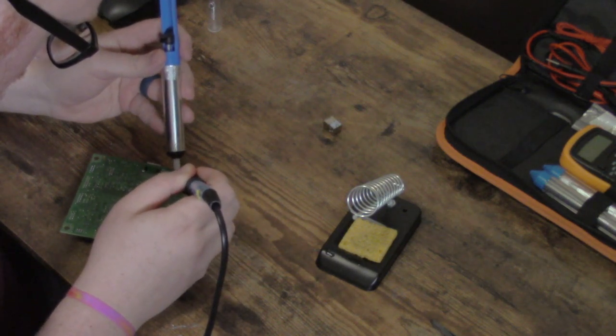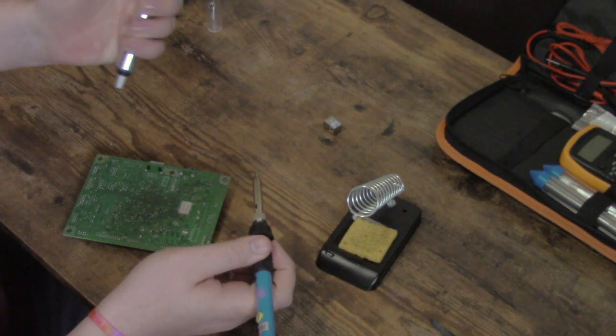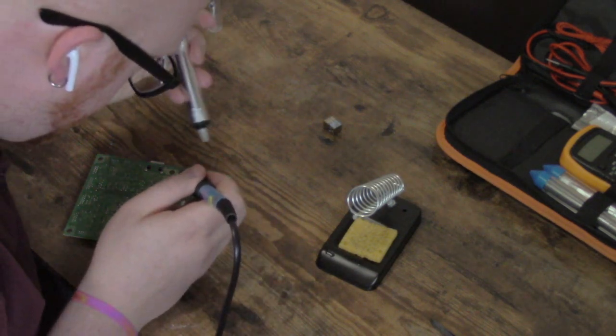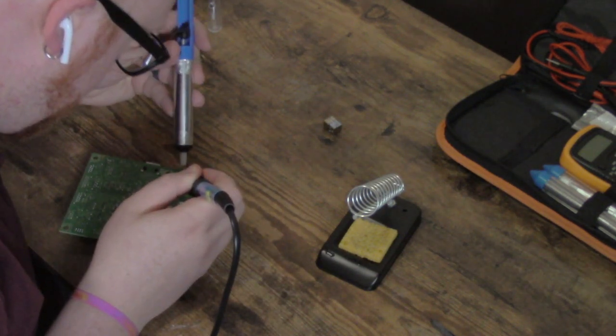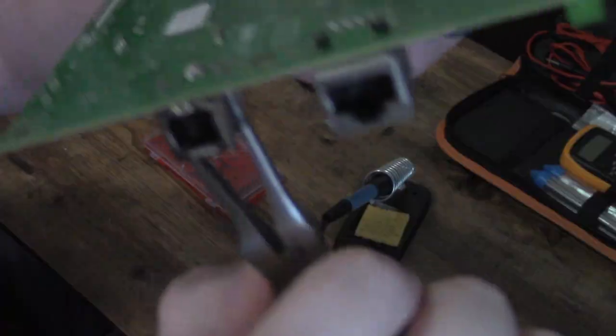Once they arrived, I sat down for about 20 minutes and replaced the port. I started out by desoldering the old port. Desoldering is the hardest part of a basic soldering job for me — it's the most technique-heavy part, and there are a lot of different tools that can help different desoldering situations. I don't have a lot of options in my arsenal right now. A port like this benefits from a heat gun and heat-resistant tape, but I don't have that. So after I desoldered the stabilizer pins, when it came to the four data pins on the bottom, I ended up adding more solder first to connect the four pins together, so that when I would heat one pin up, the heat spread to all four of them and I could wiggle them out all at once.